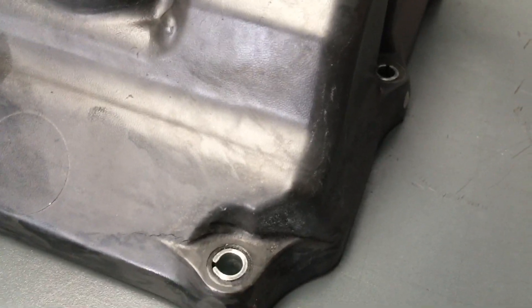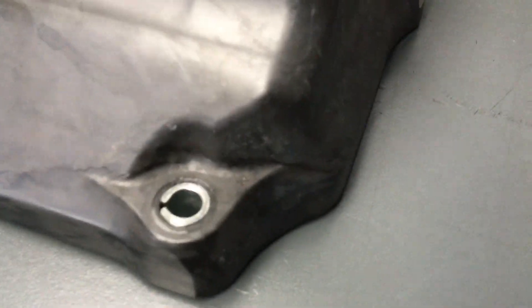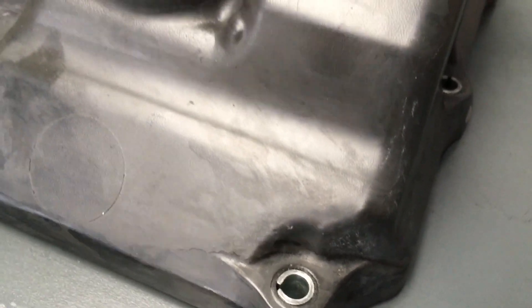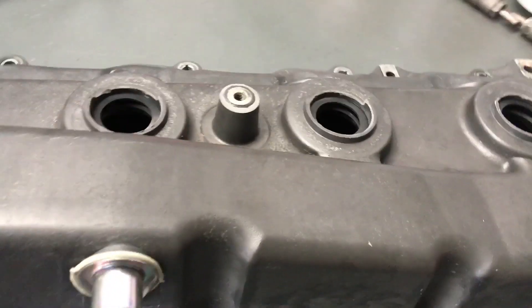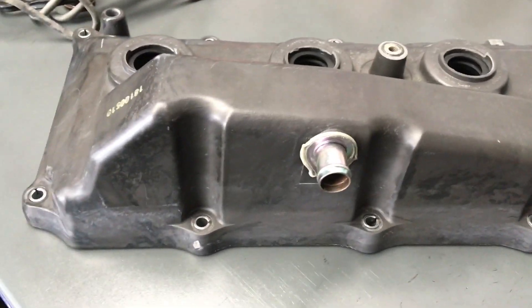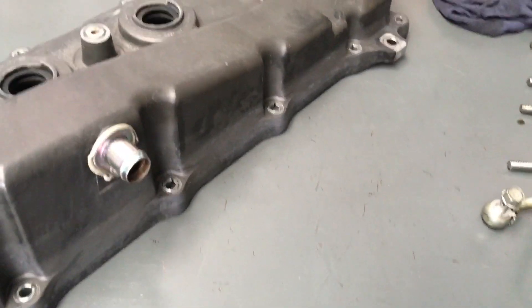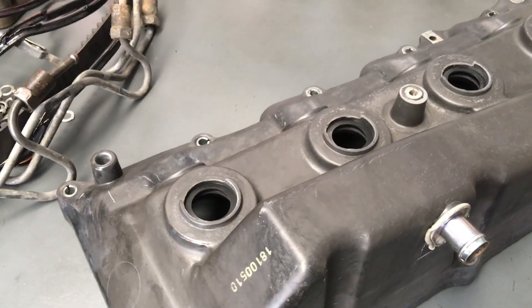As they're older we see more of these problems. So there's a cheap way out — you can smear the gray max over that crack, let it dry, and put it on later. I'm about to call the client to see if he wants to spend another 300 bucks or whether we go the cheap shortcut, because we can make it work. Anyway, all the parts are just cleaned up and ready to go back together. Hope that's helped — see ya.